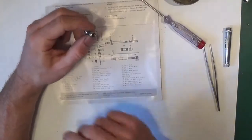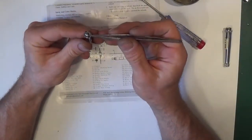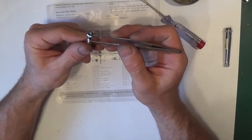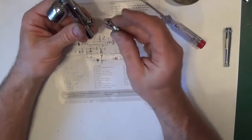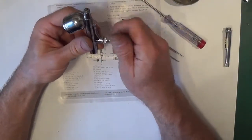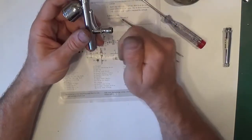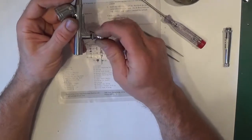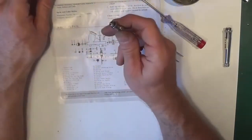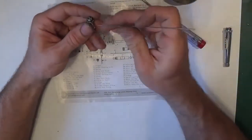Here we've got the valve body. Now there are two seals. There's this one here that when you screw to the body, this seals to here. So there's that seal. It's when you tighten it up. That's why everything only has to be hand tight. There's no need to tighten it with pliers and that. You will just ruin the seal and leaking. That seal, you remove the same.